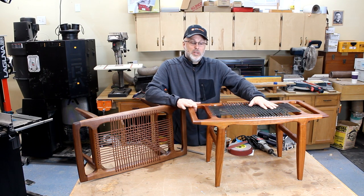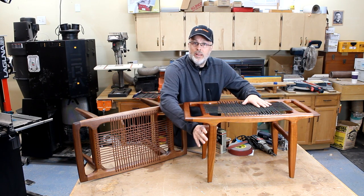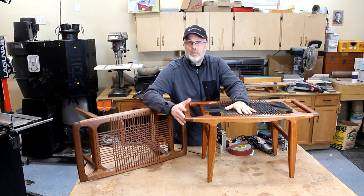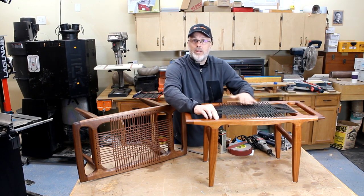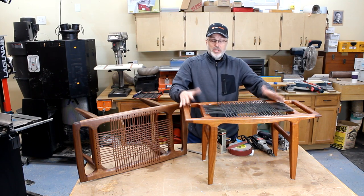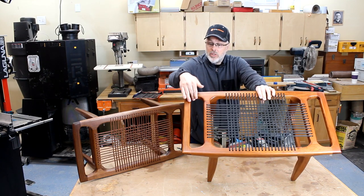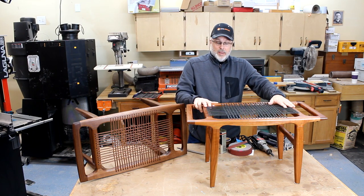This is based on the Maloof original design. The main differences between mine and the original: the original uses turned legs — these are just square cut to taper, then I rounded over the corners, so not quite the same look. I didn't have a lathe at the time, though I do now, and if I build another one I may consider doing actual turned legs. Maloof also did a through tenon coming off the turned leg protruding through the upper rail; I chose to use a floating tenon joint instead. The bench is essentially mid-century modern design — the key characteristics are the flowing, sculpted joints where the rails meet the legs and within the curvature where the side rails meet the front and back rails.